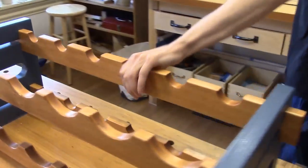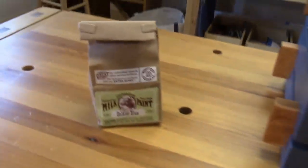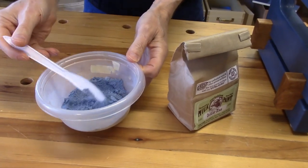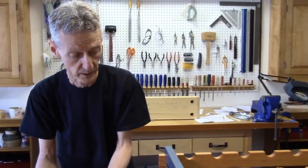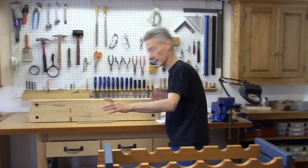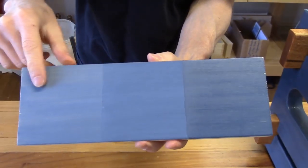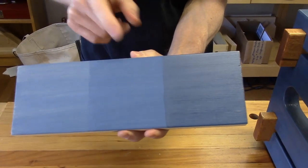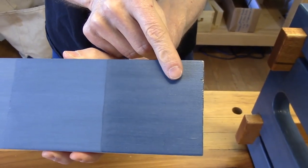You can buy it easily in a lot of stores. It comes in a bag usually like this, in powder form. It's a blue powder — in this case blue — but it comes in all colors. You mix it with an equal quantity of water, stir it up, and in 15 minutes you have paint. It's water-based and non-toxic. When you put it on your project, here's a sample — this is the first coat, it's kind of a wash coat, you can see the wood through it. It dries in about an hour. Here's your second coat, and that looks really nice — solid color with nice streaks to it, and it's dead flat. Now you can use it just like that, or you can put a varnish or an oil finish on top; it's compatible with that.